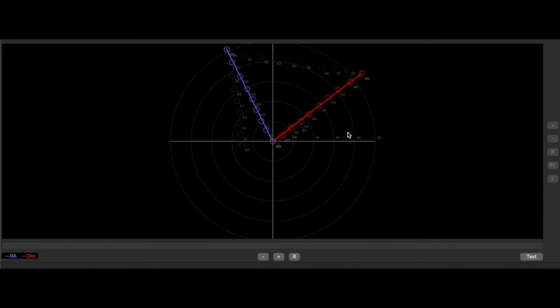So here we have a calibration session that I settled with. I had a lot worse, I'll tell you that. Here we have the west steps looking quite nice, uniform step size, and then we have the east steps, not too well. The step size is quite uniform and nice, but it kind of drifts off south. And then we have the north step, that was quite nice, and uniform step size, not perfectly orthogonal to the right ascension, but not too bad. The south steps were kind of, well, the step size was okay, but we have a big drift off west. But I settled with this because I had a few worse ones before that.